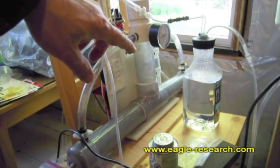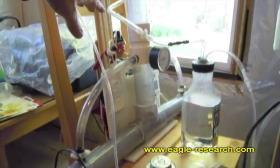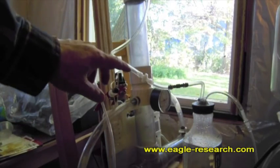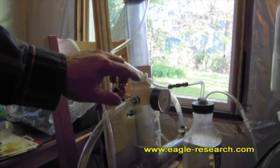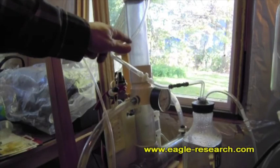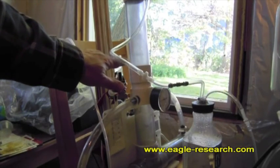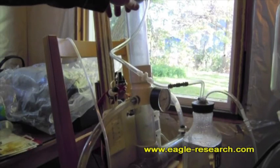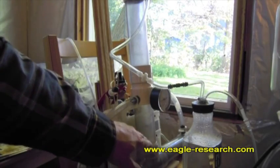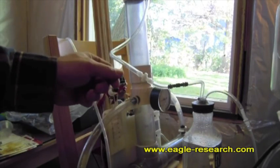The third thing I did is I took the original cap off and made an extended cap to make it higher, as you can see here. This also helps keep the foam out of your water — foam in the water would put lye in the water, and you don't want that; you just want pure gas going out. So I've extended the tower with a small cap down here that fits on, an extended tube — I like to use clear plastic tube because then I can see what's going on — then drill and tap and put a fitting on. Very simple. Taller tower. So if there is foam building up down here, it doesn't come out with the hose as easily, so you don't have to worry too much about the foaming problem even if you do have a foaming issue.